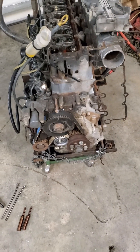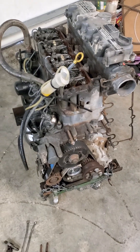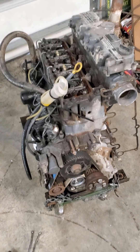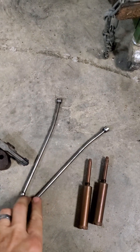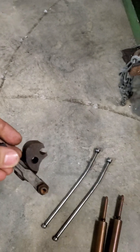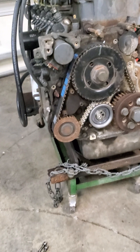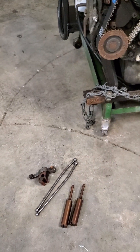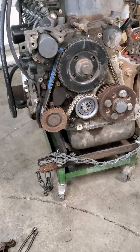It has a timing belt which makes it really funky to figure out when it's not running. If you buy an engine like this or a machine with no history and the seller doesn't know what happened, the first thing is to pull the valve cover off and check how many bent push rods you have and if you have any broken rockers. Most likely the belt broke on this machine, bent push rods, rocker arms got broken, and then they reinstalled a new belt and it never started again.